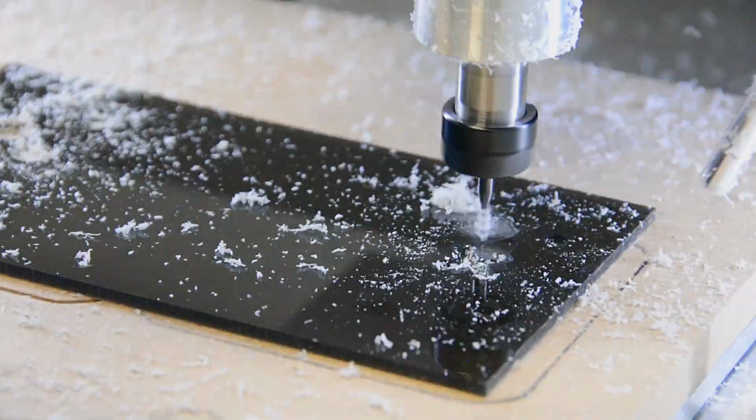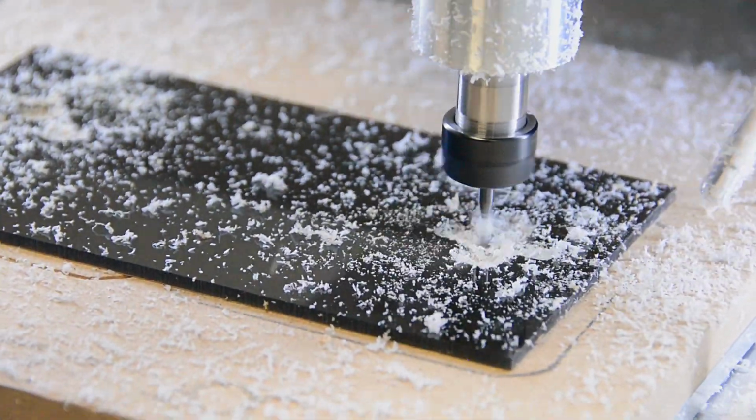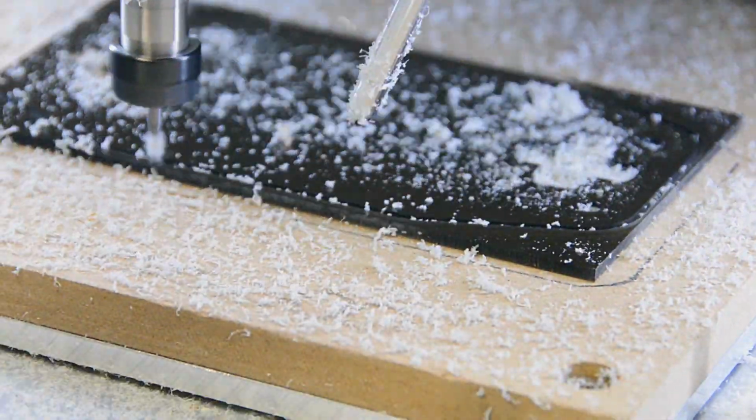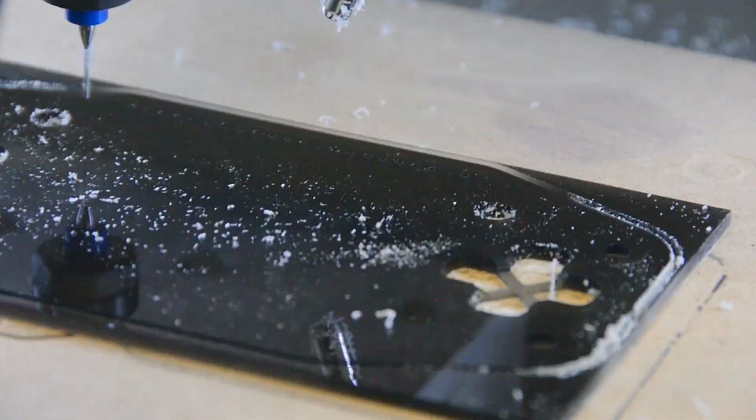The acrylic face and rear panels were milled from 3mm cast acrylic, using 2-sided operations. First to mill the pockets out for the hidden magnetics and to make space for the D-pad and fan. Next, drilling out the 1mm speaker grills and vents.